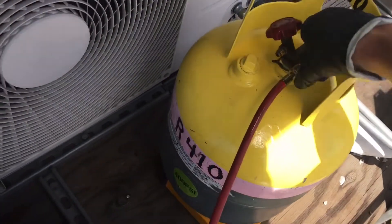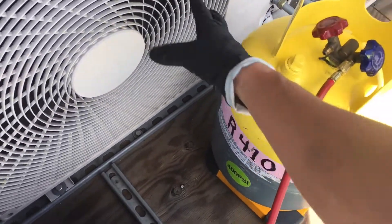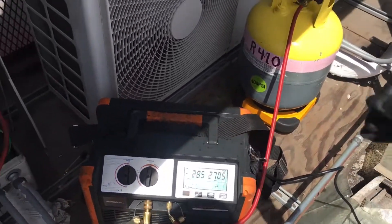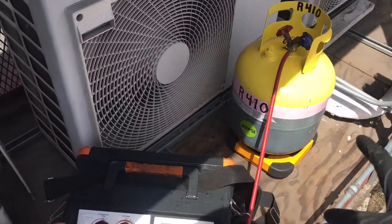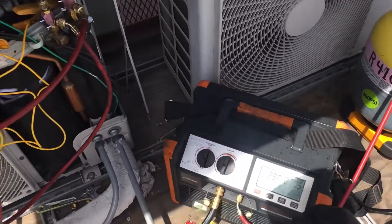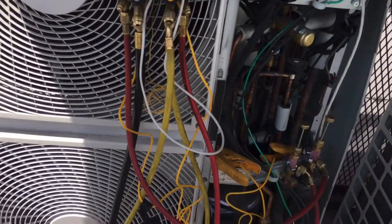Open up the tank. Unfortunately I don't have an empty tank, and the tank's not chilled. We're going to be doing this with hot 120-degree air going right over our tank — which is the worst possible condition. We're already at 270 PSI. Let's say this is like being in the Arizona desert; we're going to pretend we're on a roof in Arizona with 120-degree heat and no water source. We're going to stress test the hell out of this thing. Going through gauges slows it down even further.